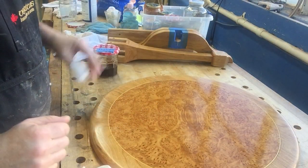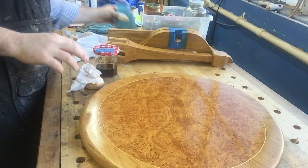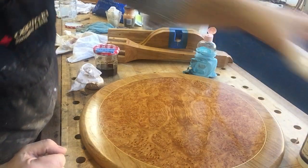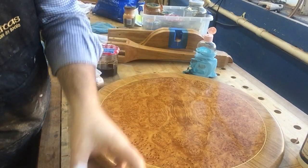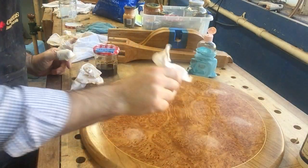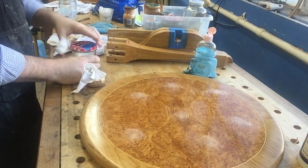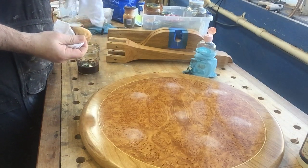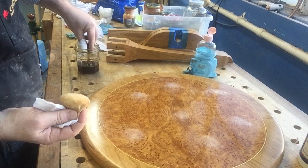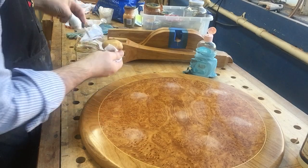These components are all done — I don't bring those to the same sort of finish as the main table. This is Johnson's baby oil, and Baylands 4F pumice. What I do with the pumice is put it in a little cheesecloth and just lightly powder the table. This allows me to fill the pores and it acts as a very fine abrasive — that's basically what it is. Then I put the shellac on.